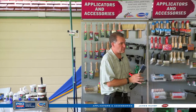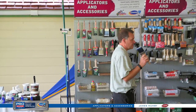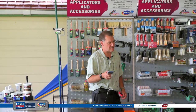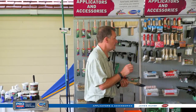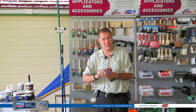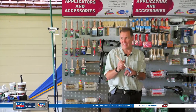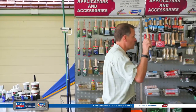We use the same nylon-polyester as in the Ultima brush. We color all our filaments prior to extruding them — we actually manufacture all of our nylon and polyester through extrusion machines. These are not dyed after the fact; the filament color is in the nylon and polyester from the raw form. So you can use this in a hot solvent without the brush color running into your paint.